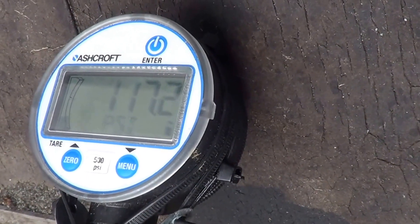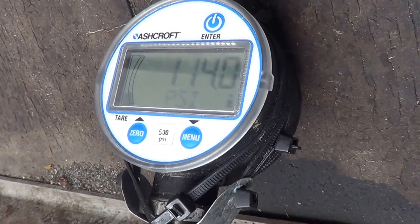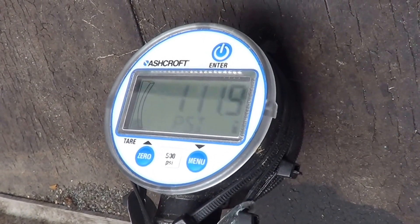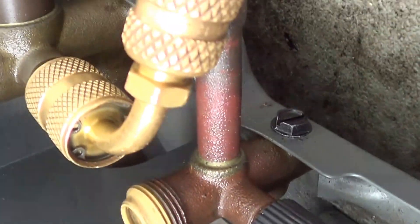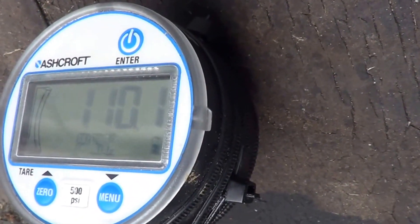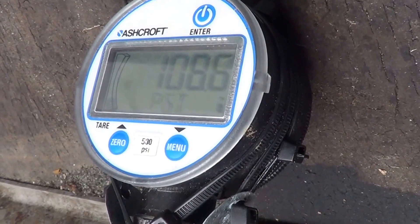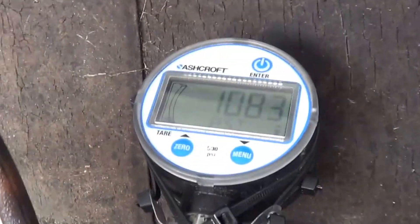This one is not pumping. I measured 15% capacity — I'll show you on the spreadsheet I use: you measure the airflow, do your wet-bulb in and wet-bulb out, and I'm reading just 3,000 BTUs. You can see the liquid line sweating now — it's pumping a little bit — but I should be at zero by now or hearing that relief valve popping. Nothing. What's happening is the compressor is leaking just as fast as it's pumping — leaking back from the high side to the low side.